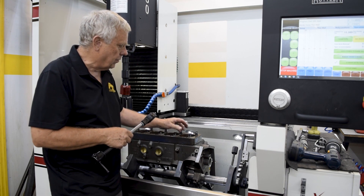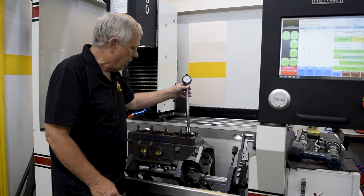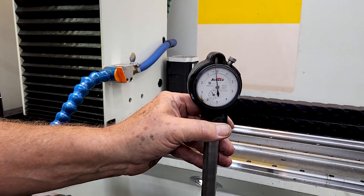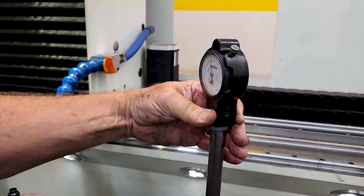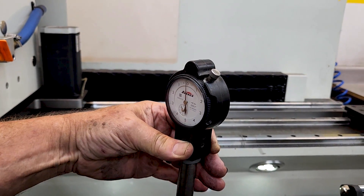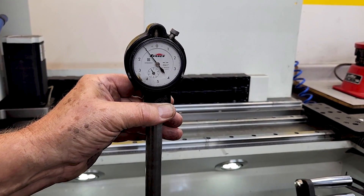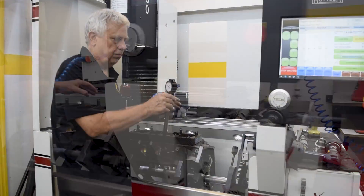So we've done some work and got to the hone. It was told it was torque plated, so obviously we put the torque plate on. Zero is basically bore size, so it's zero there. And then as we rotate around, you can see it's down — about a half thou out of round around there. So we were convinced at that point it was not torque plated.